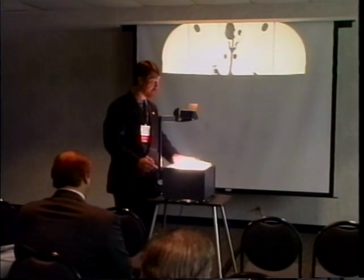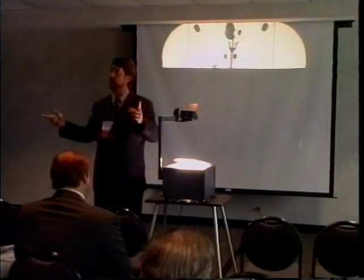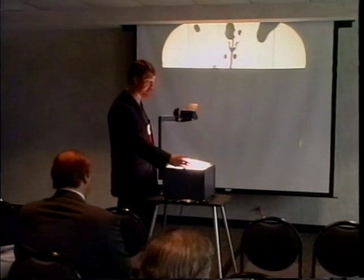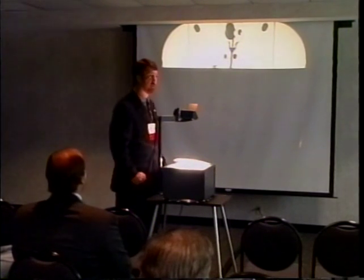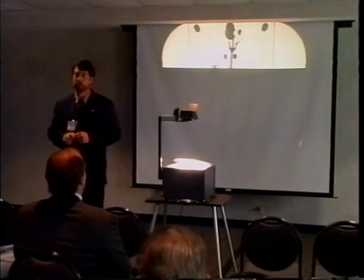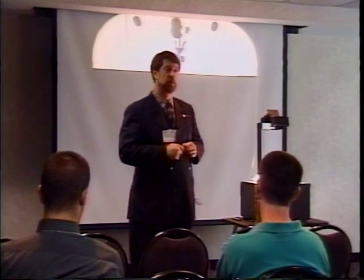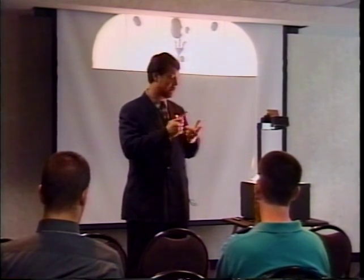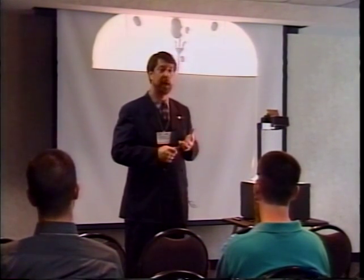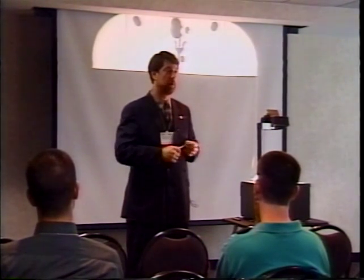And again, the most important thing is that it's equal. You want the same thing taking place on one side of the line of centers as it does on the other side of the line of centers. Okay, so that's our guard pin clearance. If that wasn't equal, what would the problem be, or what could the problem be? Well, we talked about banking pins being okay, roller jewel being okay, four corners being okay. Right, the guard pin itself could be bent one way or the other.